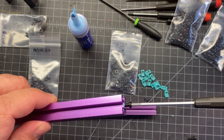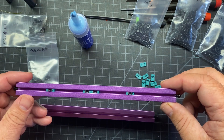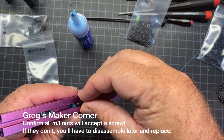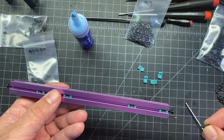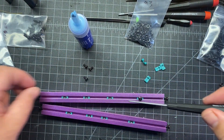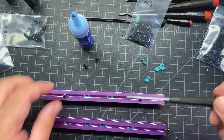The M3x10s go on the ends. For these extrusions, you're going to need four total M3 nuts, and I'm using the T-nuts here. It doesn't really matter exactly where they're at because we're going to be adjusting the distance in a later step. I recommend checking to make sure you can put a screw all the way through to each of these nuts, because sometimes the machining of the inside isn't so great — you don't want to run into that later. Put M3x6s on the outsides and leave two M3 nuts on the inside; that's for the stepper motors that will be put on later.